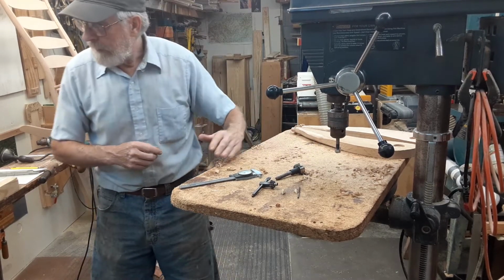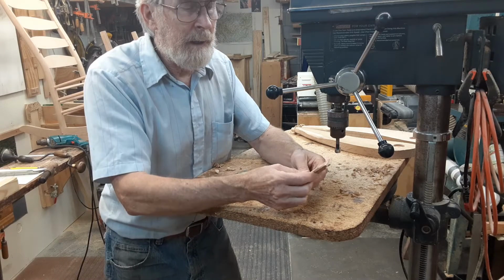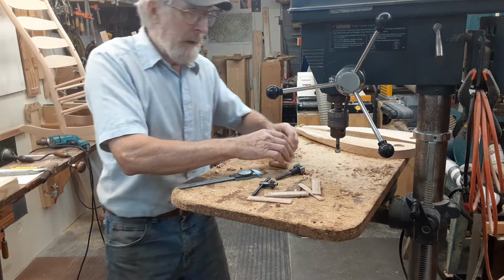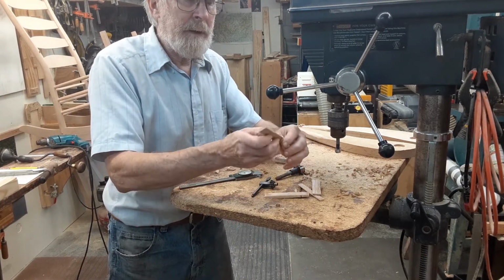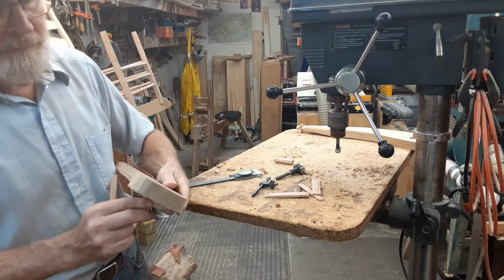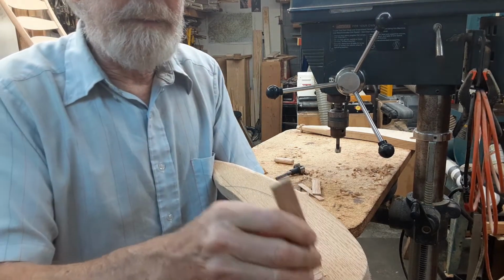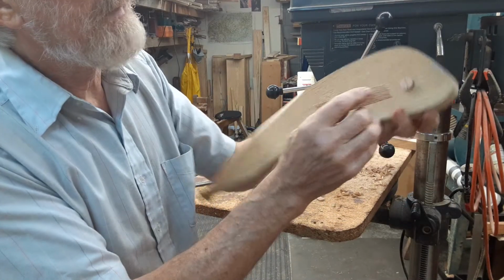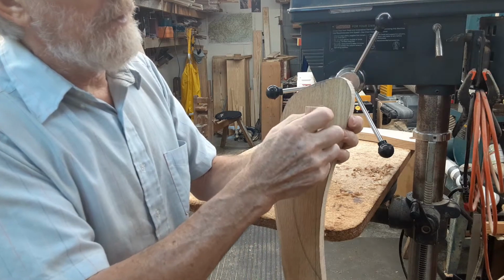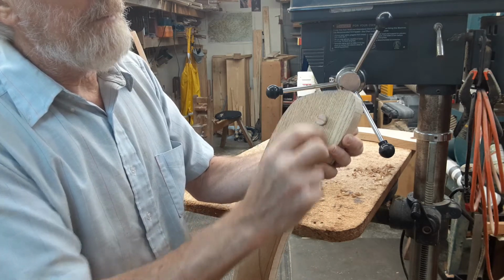So anyways, let's see, that's the other thing. I've still got to make my wedges. I haven't made them yet. But I need to have 2 wedges that are the full width of the peg, because they're going to be the ones that are on the top here. They've got to fill up the whole width of that hole on the top. So you need to have 2 wedges that are full width and are going to completely fill that space up.